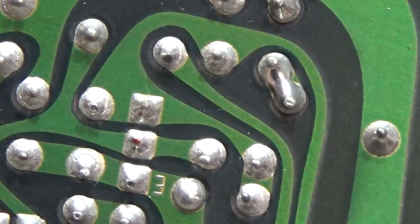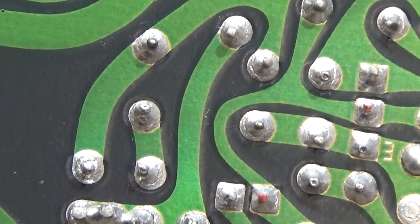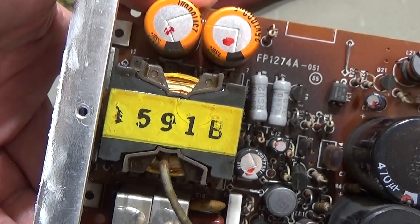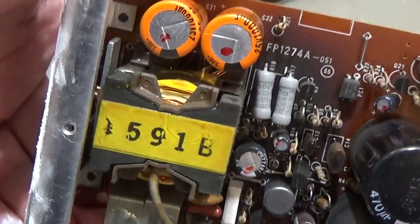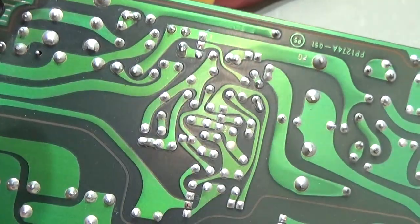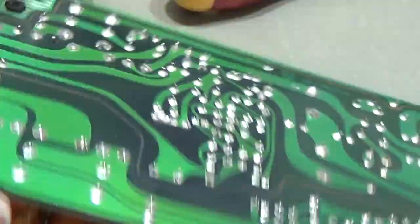So the temperature is a problem. The board is getting so hot that sometimes it reaches a very high temperature, which already has an impact on the solder joints. And additional to that, simply due to our transformer, which is working, I don't know, between 60 and 100 kilohertz, we have a mechanical vibration, and these vibrations, of course, lead to cracks after a time as well. So all together, heat and time and mechanical vibrations finally end up in what we see here.